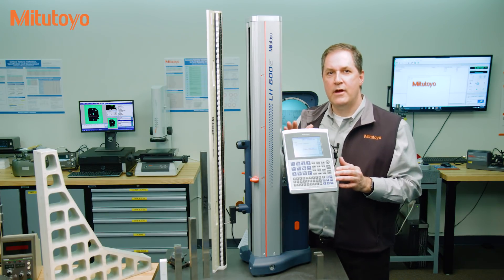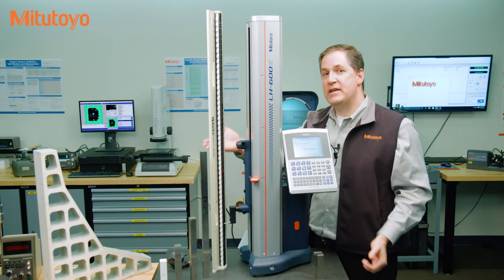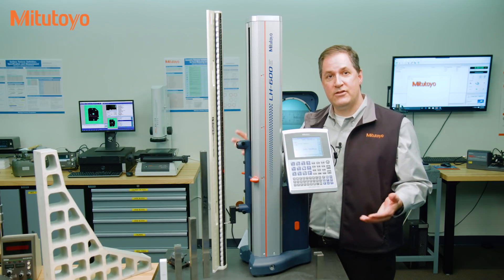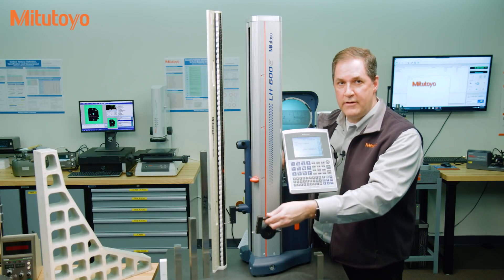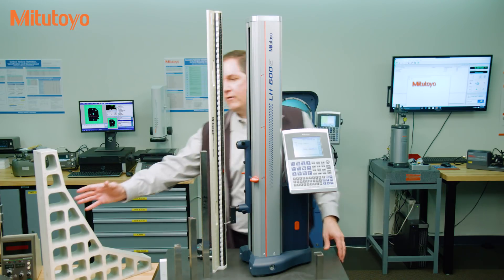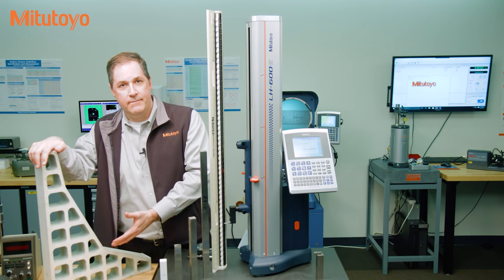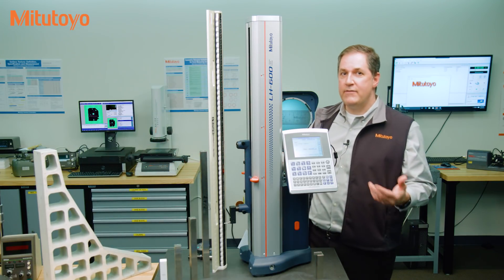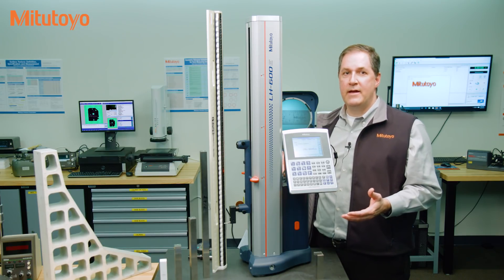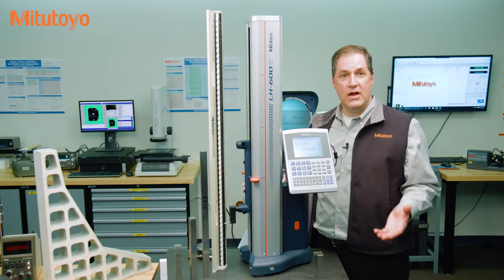Before we discuss the third type of calibration, we need to talk about what needs to get calibrated on your measuring equipment. For this linear height gauge, if you're only measuring heights, then the test with the checkmaster for height measurement accuracy is the only thing you need calibrated. However, this linear height gauge has additional functions — it can measure straightness and perpendicularity, and if you're using those functions then you need additional items calibrated, such as this ceramic square. If you're not using those functions, you don't want to waste money getting that calibrated. As the manufacturer we can give advice, but the ownership of what needs to be calibrated belongs to you, the user. Organizations are often not getting the right things calibrated, which can waste money or expose them to quality risks.